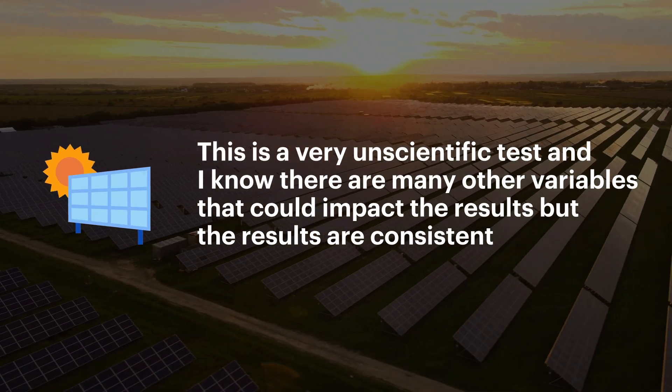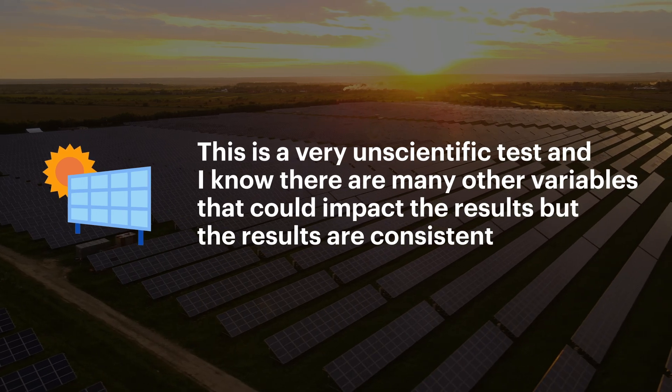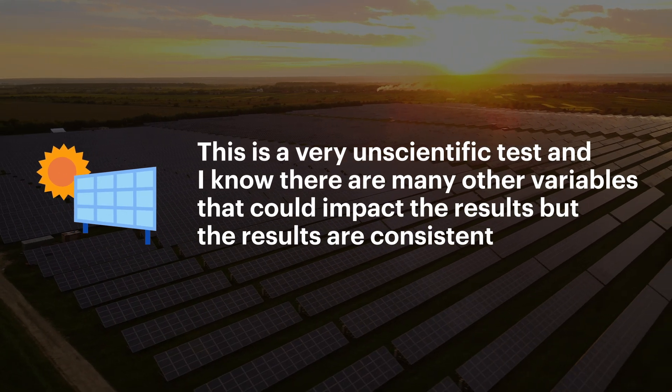The question I was answering is: is it worth using thicker cable for solar extensions? A big mistake people make when starting out with solar is thinking they can extend solar panels to their house using thin cable. Solar is all about current — it carries a lot of current. With good sunshine, a solar panel cable can be carrying 9, 10, 11, 12 amps of current.